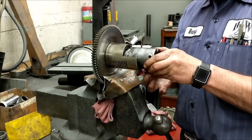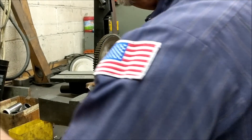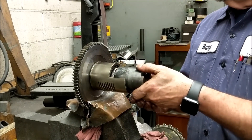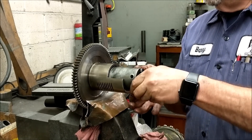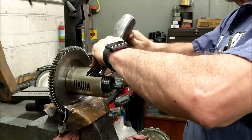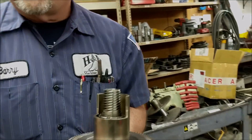Once it's started, I'll take my tool and get it to where I know I'm threaded on. Then I take a little blue Loctite and put a couple of drops down on the threads — because if this ever backs off, you're going to tear your machine completely apart again. This is where I tell you: don't be shy. I use a flat punch. You do not want that to come off. It spins real good — there we go.